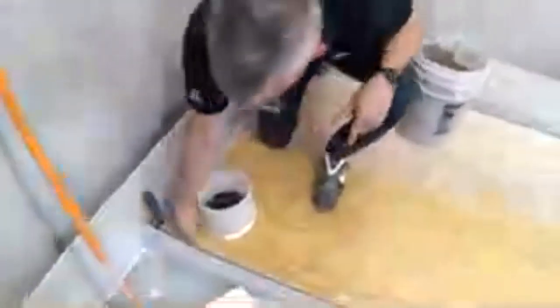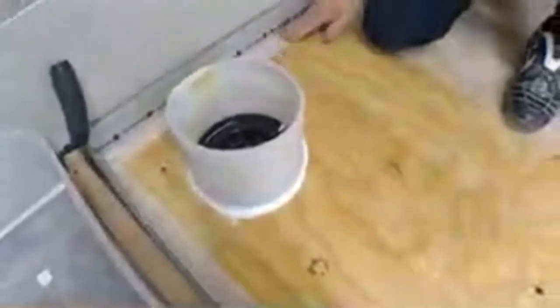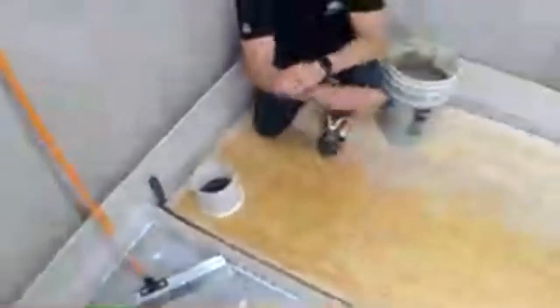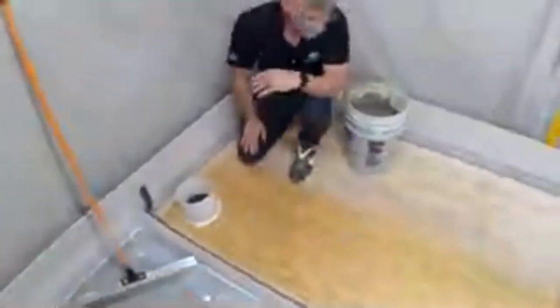So guys, go through your project. I like to caulk everything. My goal when I do a self-leveling job is not to have a single leak. I want to check everything. If I've got seams in the plywood and I need to put down some patch or some rapid thin set to fill those, or do some caulking, I don't want to have a single leak.